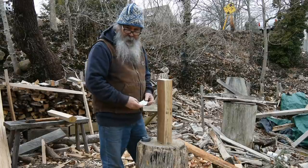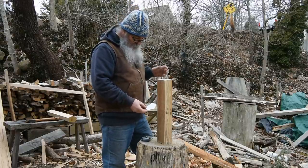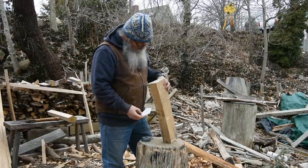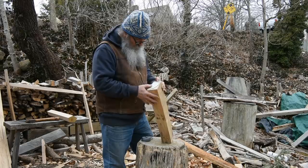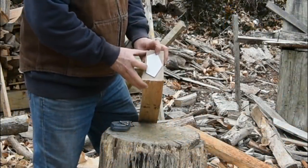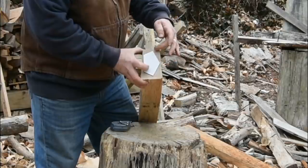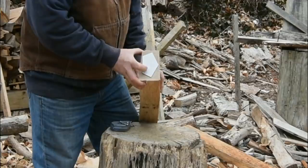From a full-scale plan of the cupboard footprint I made this little template out of mat board, and that will sit here and I'll use it as a guide. What I'm going to do is snap three chalk lines — one representing each of those points — and hew off these two outer front corners.